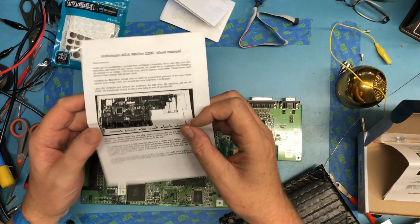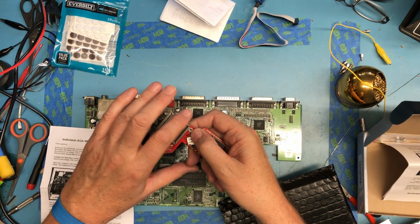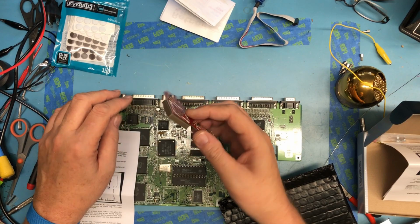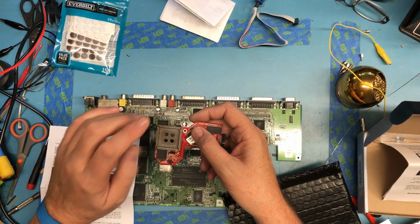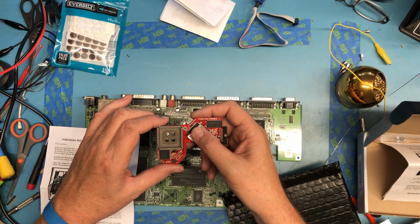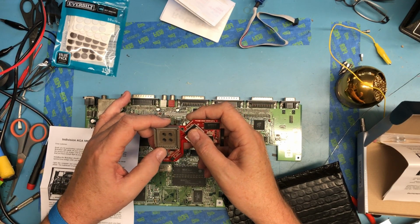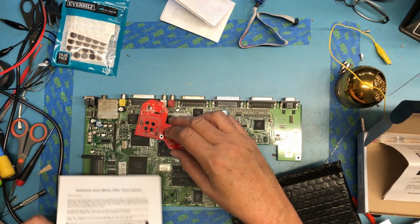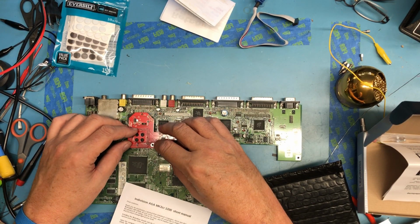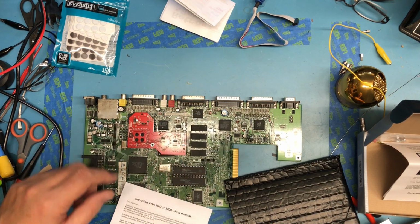It basically says in the instructions, well, there's a couple of notes here. This socket's been machined to kind of allow it to go onto the chip from the opposite side. Normally the chip would drop down into it with the face up, so the socket's really being applied upside down. These little standoffs inside of here have been milled off. They've taken some plastic off around up here as well. So it's an interesting concept. It does seem to drop down on nice and solid.